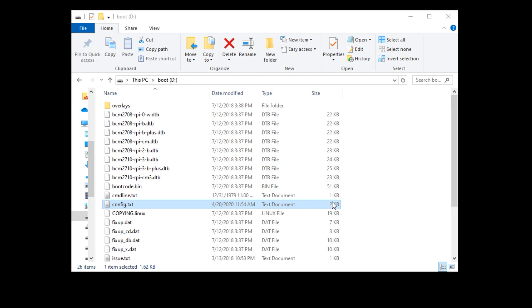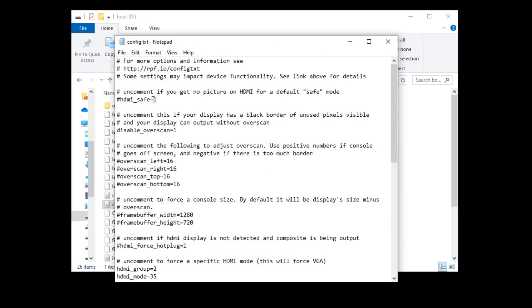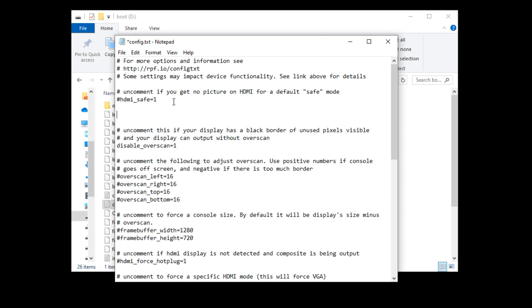The first thing you want to do is put your SD card with the image on it into your computer. It's going to ask to format — don't format it or you'll wipe everything. Just select the partition and go down to config.txt. Double click it and it'll open up in Notepad. I'll put all the code in the description. It's display_rotate equals 1 — there's no hashtag, it's not commented out. One would be 90 degrees, or you could do 3 which would be 270 degrees. You might have to try 1, boot it, make sure it's the right direction, and if not change it to 3 and save.